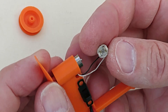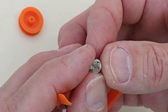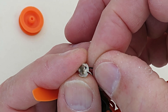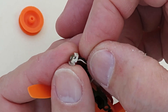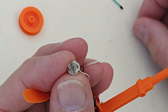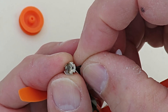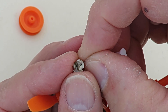Alright. So what we've got is this black wire - I think it's actually broken in the insulation, and we need to try and strip it back and push it back through. So it makes solder contact there. I expect if I just pull that, it's only being held by the plastic insulation, and the wire inside is actually broken.